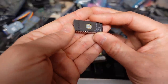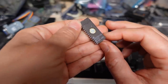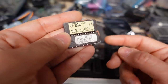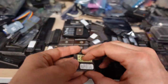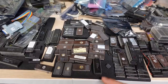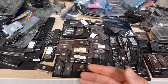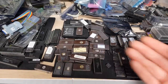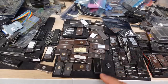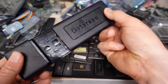What's amusing to me is that often when I'm working with these chips, they'll be sitting around with the window exposed, and I always get a million comments saying you have to cover that up or the chip's going to get erased. When chips were used in production, the manufacturer just stuck a paper label over them — sometimes metallic so no light can pass through. I'm not sure what people think is going to happen with chips sitting on my bench. I'm sitting under LED lighting in my basement — there's no UV light floating around in here that's going to erase these EPROMs, and some have been here for over a year with the light on almost all day, and nothing has ever been erased. You really need to expose them to UV light from an eraser to actually erase them.